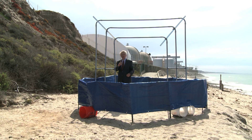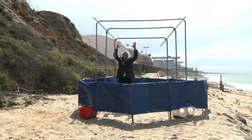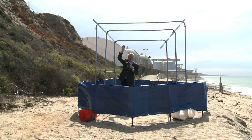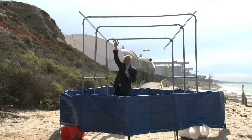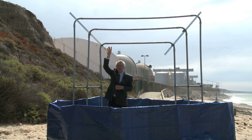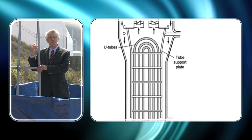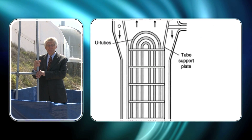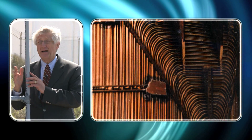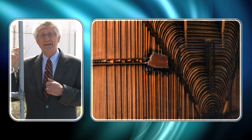But plugging doesn't stop the vibration, because on the side I'm on, you've got non-radioactive water turning to non-radioactive steam up above. This U-tube is actually much taller than I am — it would go up 20 feet, and above me would be high-pressure steam, but non-radioactive. As long as these tubes don't leak, no radiation gets out. The new steam generators with their crammed tubes are banging into each other and into the supports — there are 9,700 tubes inside those domes behind me in each steam generator.